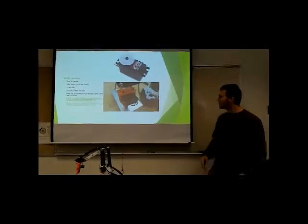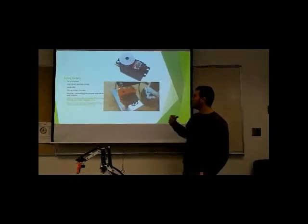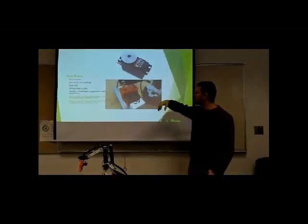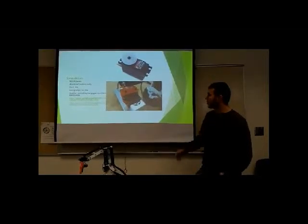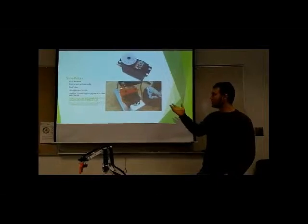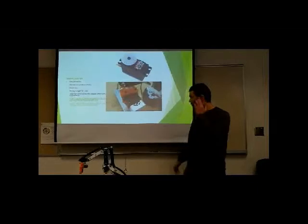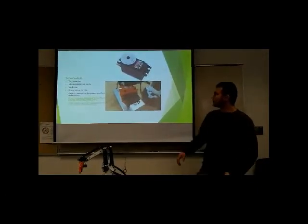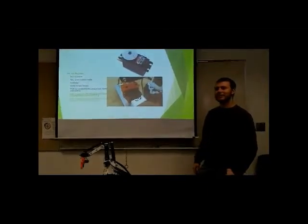In the motor stage of the project, we used two servo motors to control the claw — one to open and close the claw, and the other to turn the claw 90 degrees. We used a two-state single input to control each claw function. Servo motors are relatively accurate to the degree of rotation and have a relatively strong torque for their size.